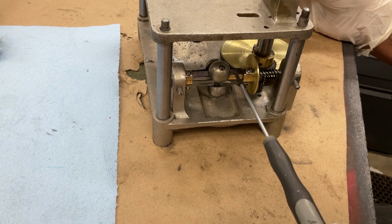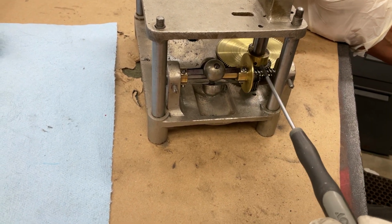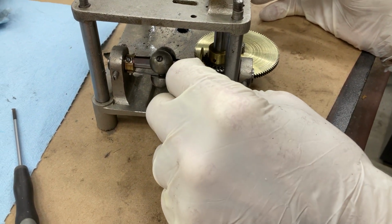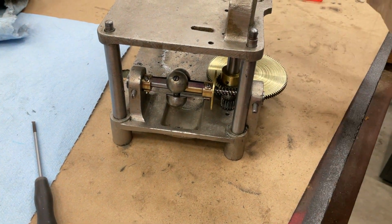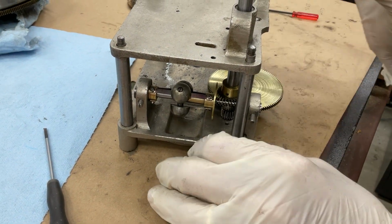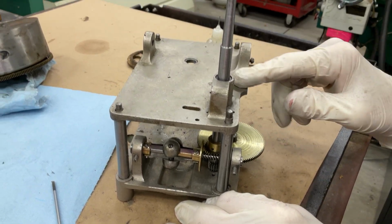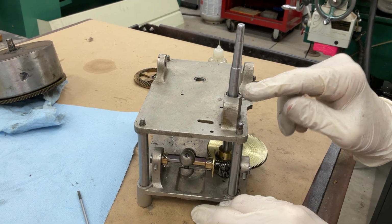I moved it just about 0.010 of an inch in so it won't hit back in here. And then I readjusted the bearings too, so there's absolutely barely any play in these. When you get them all together, we oil it. This is pre-set up. I'm only using sewing machine oil now, but when I put it back together, I'm going to be using STP in this bottom piece here, and then sewing machine oil on the top.